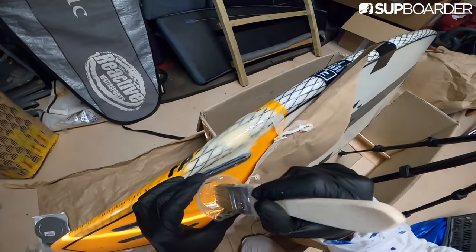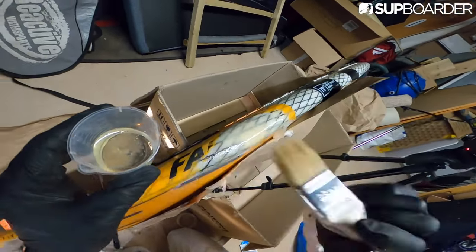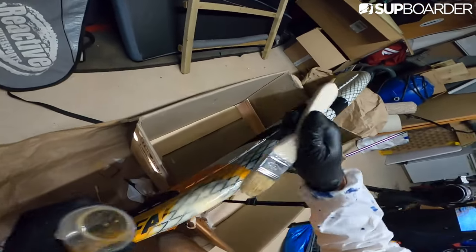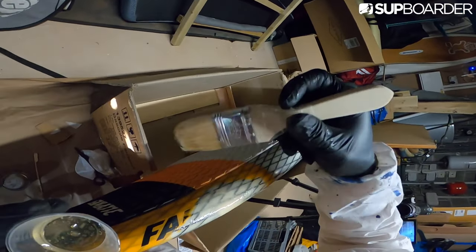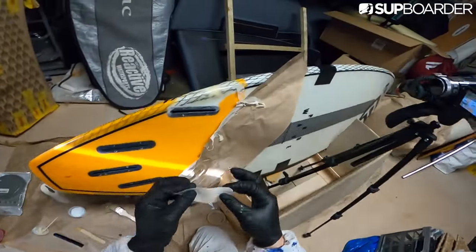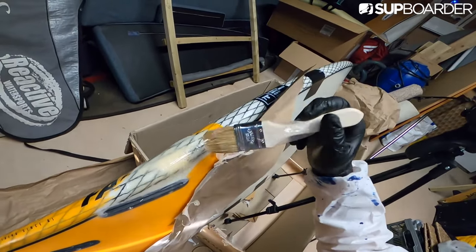There's a bit of surface tension from the other side really. Struggling a little bit to get that edge to stay. So I just keep working it, maybe get a touch more resin into it, just stippling it, breaking down the glass, making sure that the resin is really impregnated into the fibers. All right, let's get that other layer on. So now this second one I'm going to pop on. Ooh, actually, let's not make the same mistake twice. Let's just paint on a layer of resin.